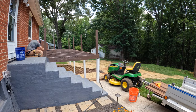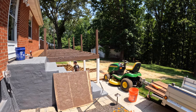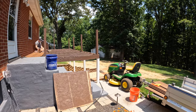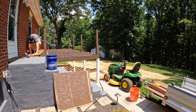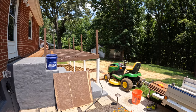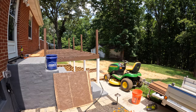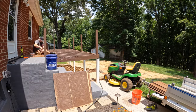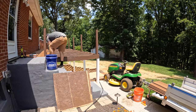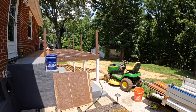The deck boards I used were Trex decking — that composite decking that everyone loves. I've never used it before and it worked out pretty good. I used the CAMO fastener system, which you can find on Amazon — I'll put a link in the description. Essentially it's a jig that you put on the deck board and it puts a screw at an angle in each corner of the deck board onto each joist. It hides the screw because it goes in from the side, but it's still nice and secure, and the jig stops the screw at the right depth.